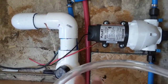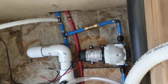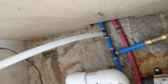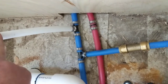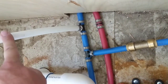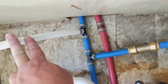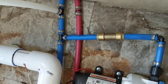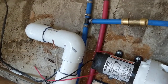You can do your drain different than the way I did mine, just as long as it will drain out when you're needing to winterize. Now, here's the other important thing — you've got to have a check valve here on this side. I bought one and can't find it, so it will go in this line as soon as I find it. But it's important that you have that check valve there as well. Otherwise, this pump will just pump all your water out of your city hookup hose.